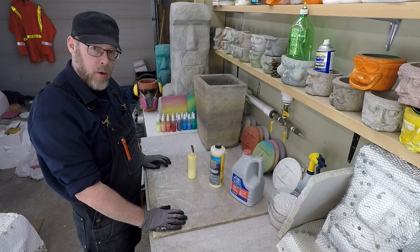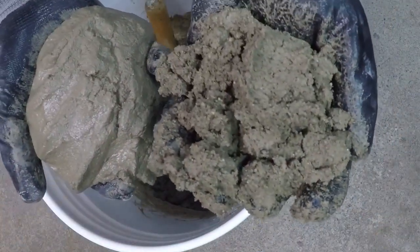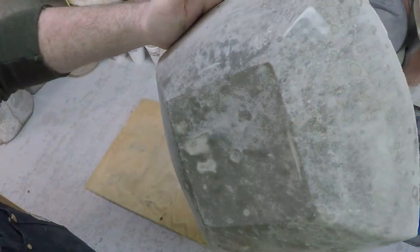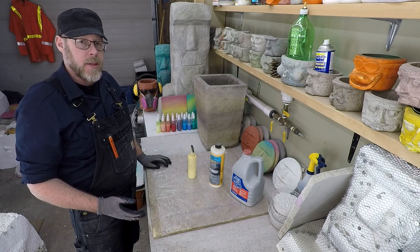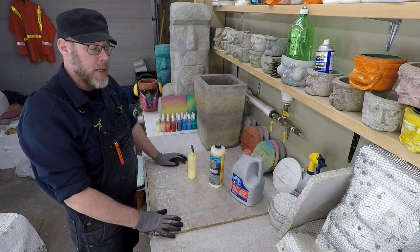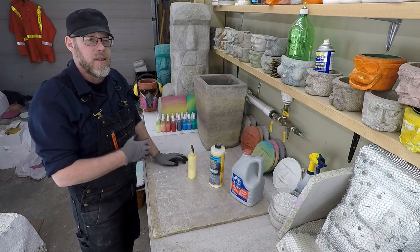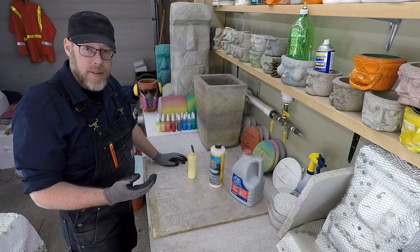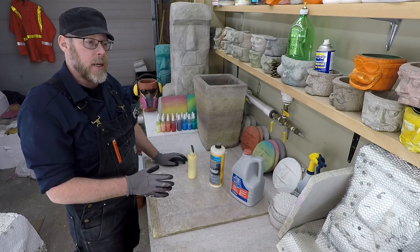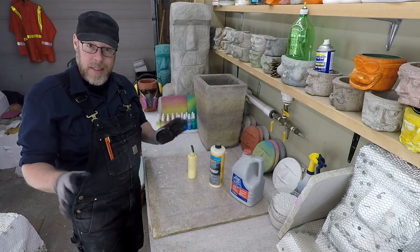Can you add glue to a concrete mix? Adding glue to a concrete mix is actually really beneficial for a couple of different reasons. It's going to change the placement and finishing properties of the concrete a little bit. It tends to feel a little bit stickier on the trowel, and that might matter to you if you're coating vertical surfaces, for example. That's one of the main times I use glue in concrete — when I want a stickier mix.